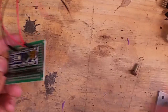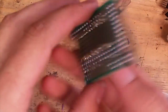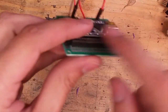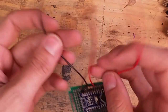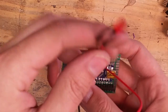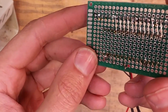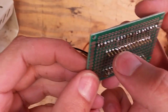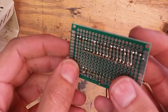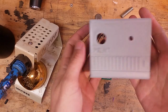I think I'm just about ready to assemble this thing — the board is done. I put the Arduino Nano on just a little piece of perf board here. There are some headers here, I've got two wires that are going to go to a push button, and then I've got an LED that's just going to show that the thing is powered on. On the underside, I used clipped resistor leads to make the connections, because there are a lot of them lying around and they make easy, good connections.